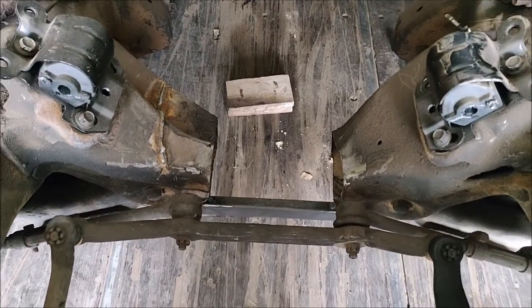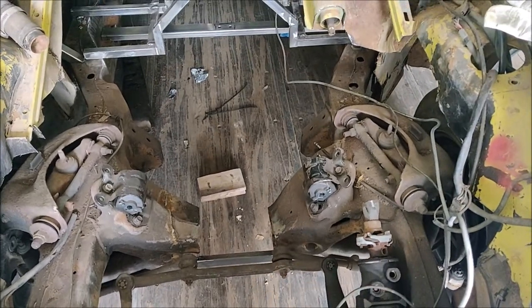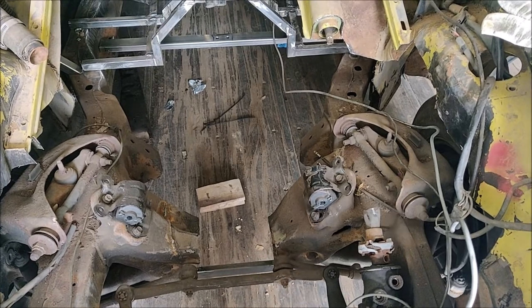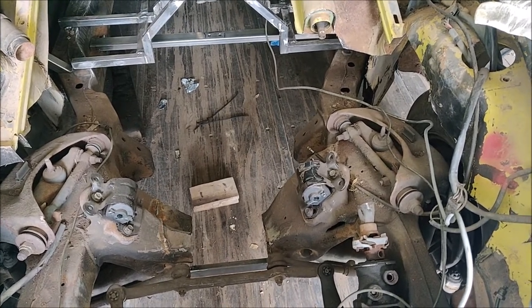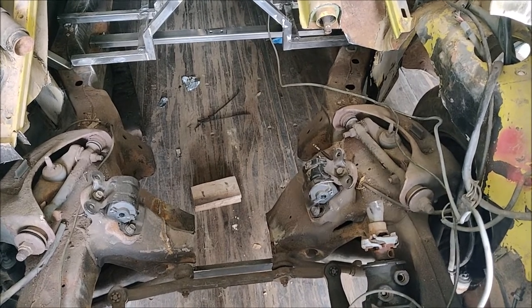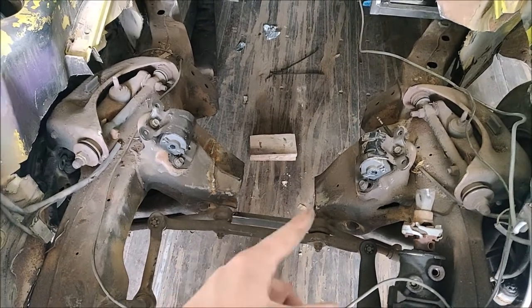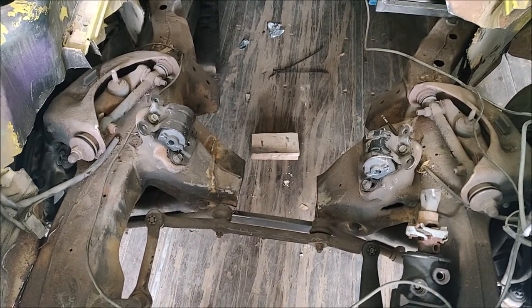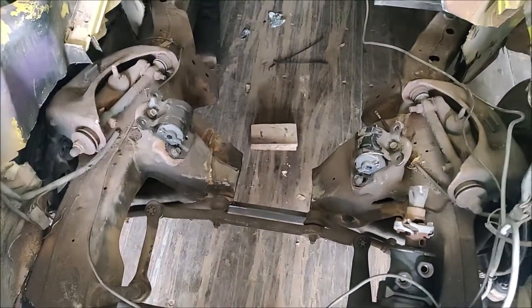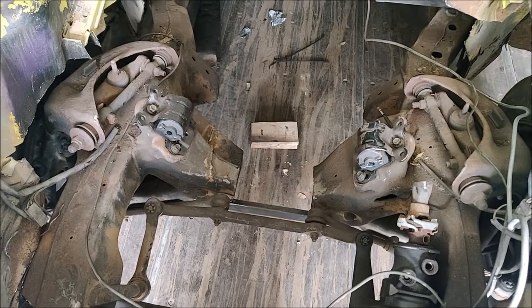You can't really see too well, but I notched my crossmember out before putting my engine in because I was told that the truck oil pan would hit the stock crossmember, and unfortunately with the swap mounts I bought, it clears and I had already cut it. So I need to buy some steel while the engine's out and weld up that crossmember, make a little support. I'll probably just throw a cap on each side and a bar across and call it a day, be done with it. It'll be fine.